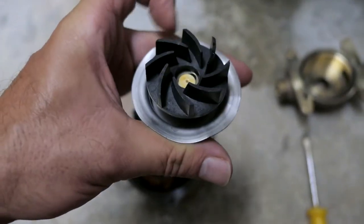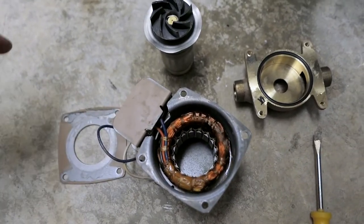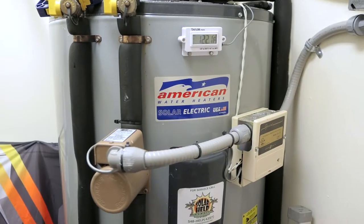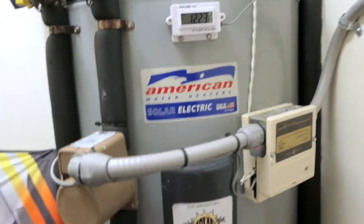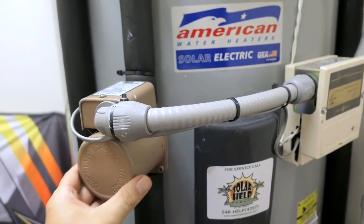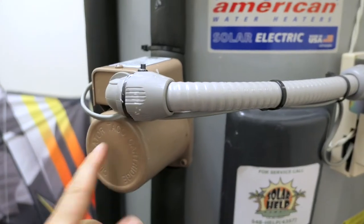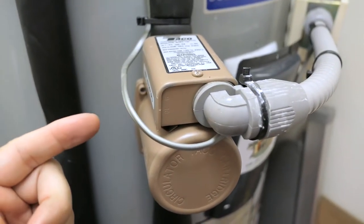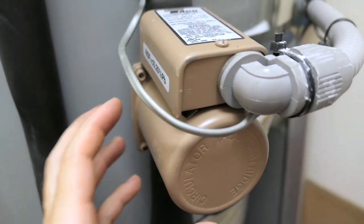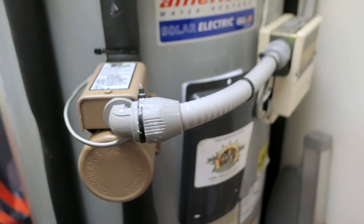Sometimes these get seized up and by opening it up and just turning the rotor it'll help get it running again. These things are not too complicated — actually quite simple little pumps. They're very durable and can run 24/7 for years and years if they have to. Everything is back together and working fine — the pump keeps turning on and off as needed to regulate temperature. If you have one of these and it's not working, try tapping on it, try opening it and turning the propeller to see if it's jammed, and check the windings to see if they're burnt. Hopefully this video will be useful to somebody — thanks for watching!